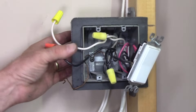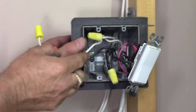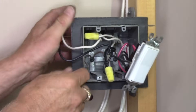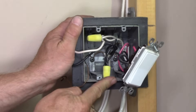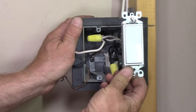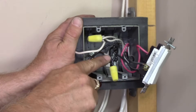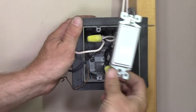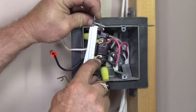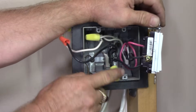Here it is in a practical situation. We have our neutral supply coming into this circuit, going out to another part of the circuit. There's a pigtail — that's our supply neutral. This is our supply hot. Pulling out this three-way switch, we're going to show you two different types: a decorator-style Decora and a standard toggle style. The important thing here is that this hot splice is going to provide the common for our three-way switch network. The black-identified screw is the common.